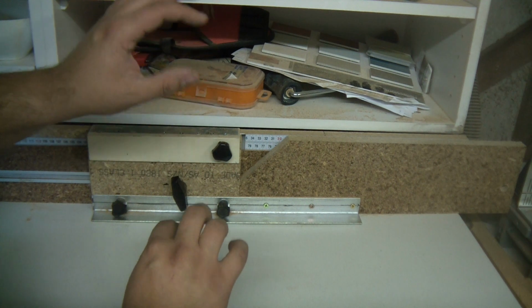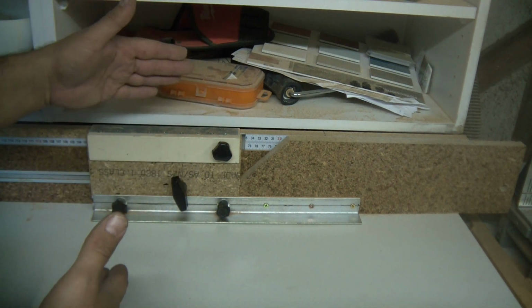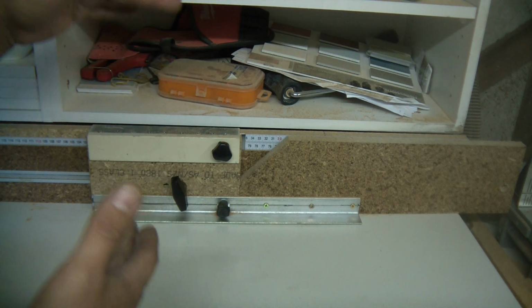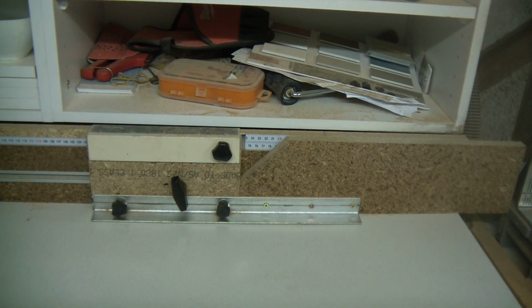30mm thick. There's a good chance I've gone 31 or 29 off the thicknesser, and if I cut those to the exact length they might be too short, and that would really suck. So I'm going to cut them 10mm longer now and trim them at assembly.